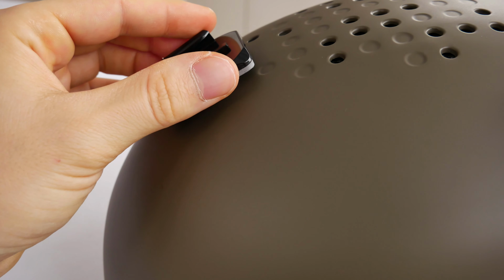Sometimes you may be using your GoPro inside a dive housing. What can happen when you change different temperatures or humidities is some fogging on the inside of the lens. Now, you can buy these special anti-fog inserts, they're pretty cheap on Amazon, but something else that works equally as good is just kitchen roll.